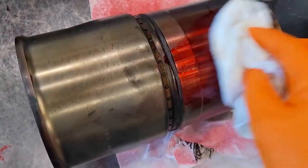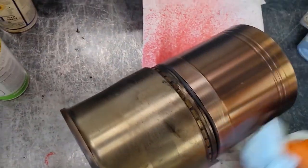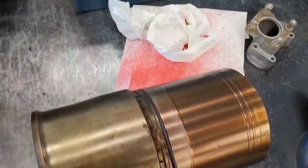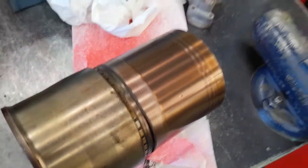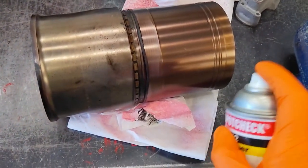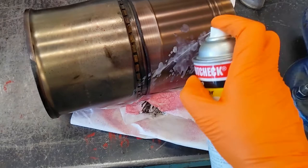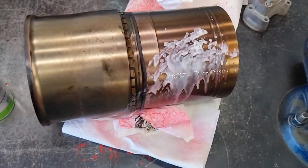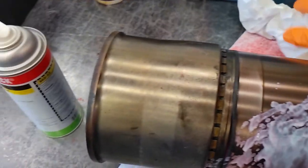Okay, it's been a few minutes. Let's wipe this clean. Now we'll spray on our developer — give it a good shake, get the finger out of the way. Spray on the developer, let's see how it goes. Let that absorb for a minute to do its reaction.